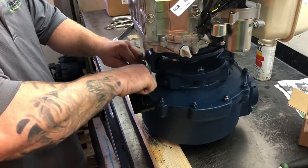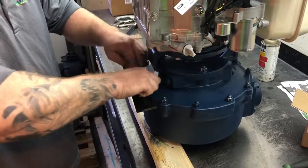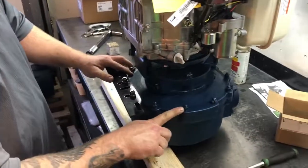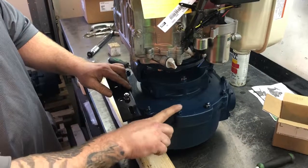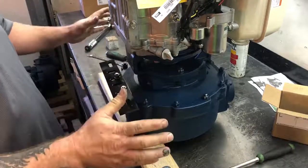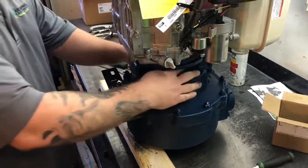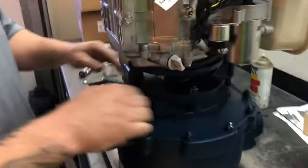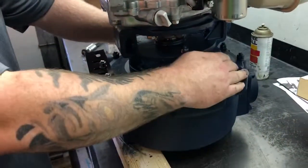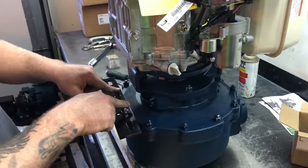And you can take these, and once you thread these on, if you were to just do it on the standard stud that comes with our pumps, you'd be right at the edge. They're just going to come off, or you're going to blow them out. It's not going to be any good. So make sure you torque this, make sure these are tight, make sure you've tightened all these to begin with. 4 up here, all the way around here, longer studs in here.